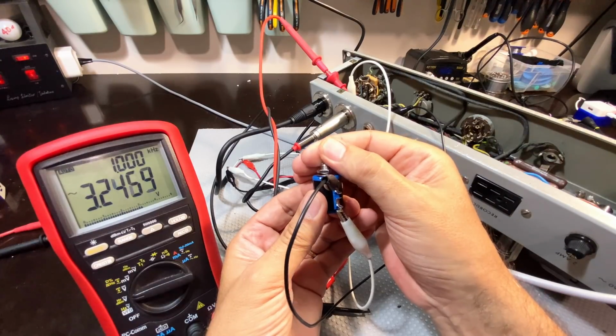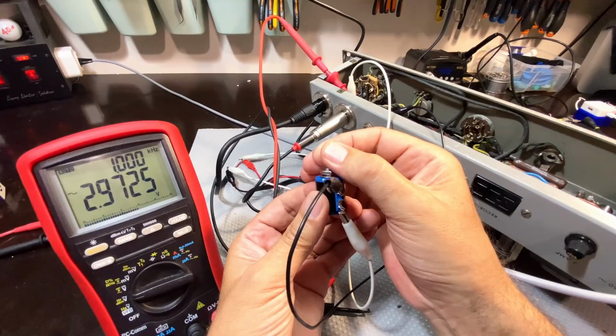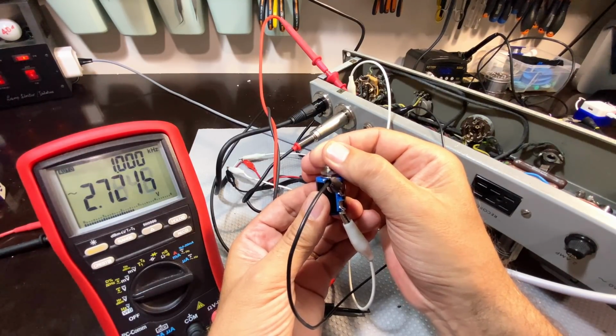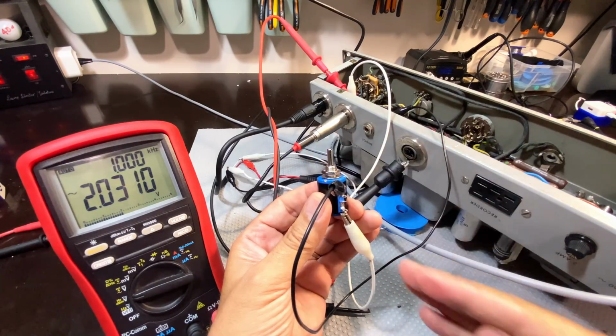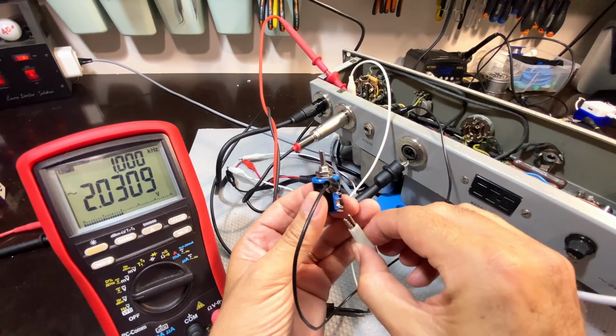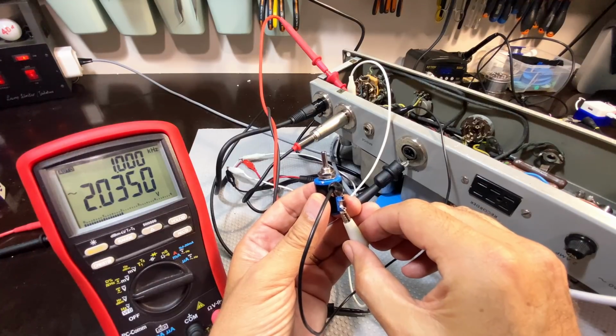And what am I doing? There is a condition that when your output impedance is equal to the load, you've got the two perfectly matched. And the result is that the actual voltage that you measure across the load becomes exactly half what you will see if it's unloaded, like that. Unloaded, 4 volts, loaded, 2 volts.